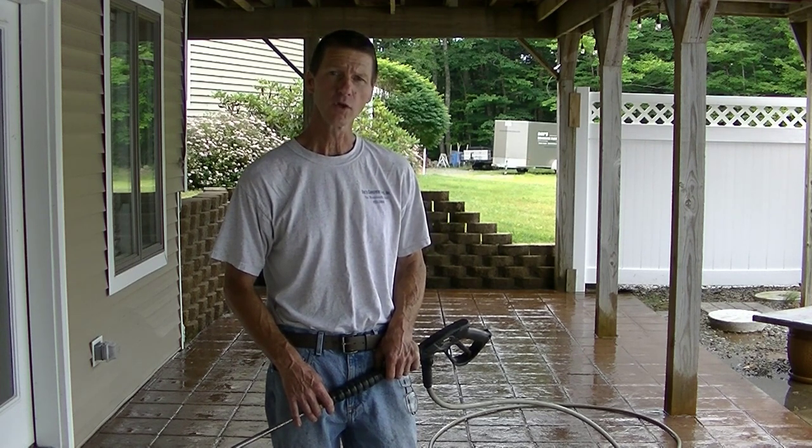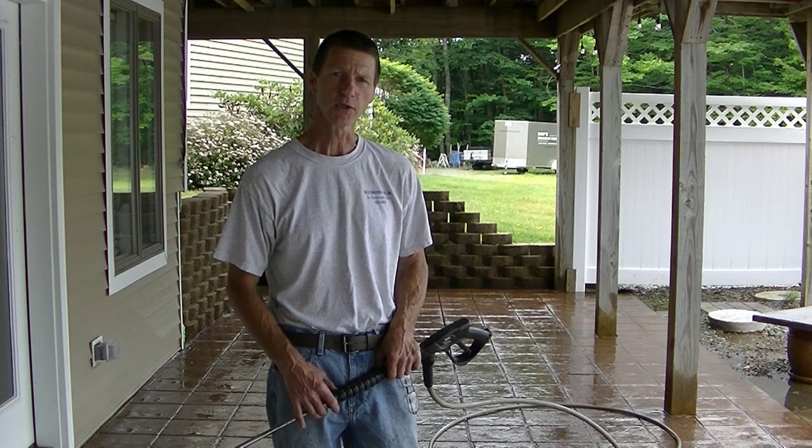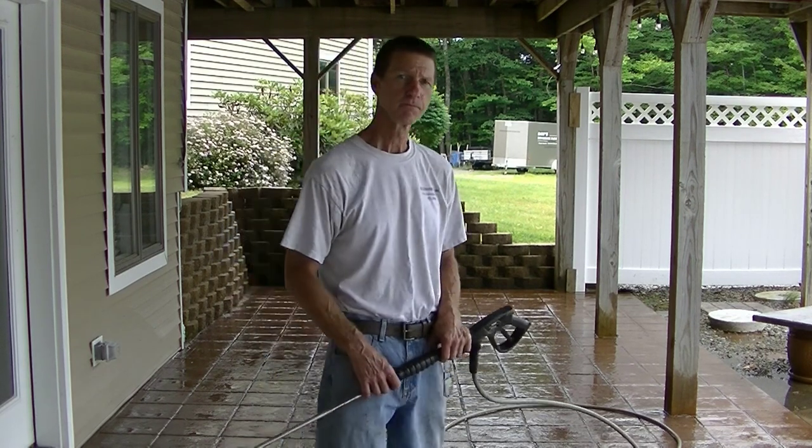If you try to seal over it when it's wet, the sealer is just going to turn white on you again. So let it dry out and you'll be just fine. Hi everybody. So it's been 24 hours now since you cleaned your stamped concrete.